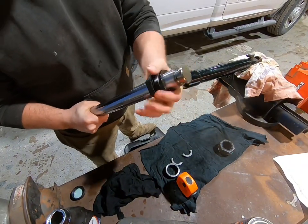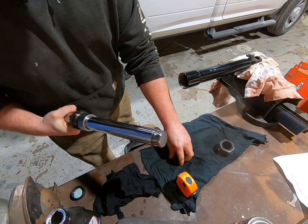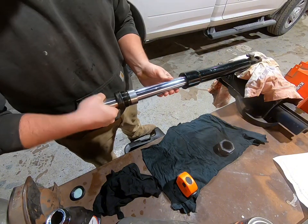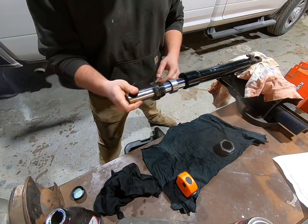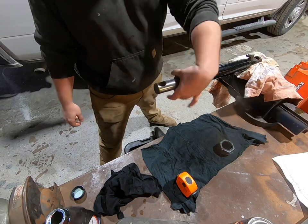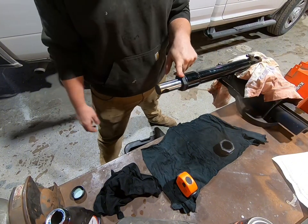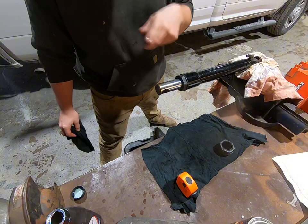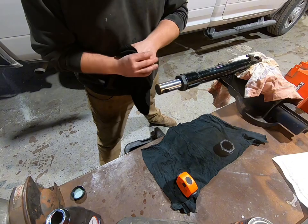Pass your little groove here for your split ring. Once that's on, next thing to go on is your bearing, and then your split ring goes in the bottom. Slide all that in your tube — sometimes it can be a little tricky to get those split rings in, but just wiggle it around and eventually you'll get it. Then it just slides back in and you can screw the gland nut back into your barrel. These are supposed to be torqued to about 150 to 180 foot-pounds, but since I don't have a wrench big enough, I'll put the bottom pin back in the plow and just get it snug with the pipe wrench.